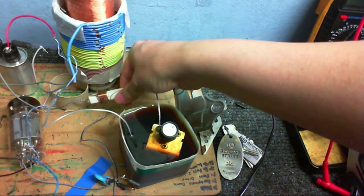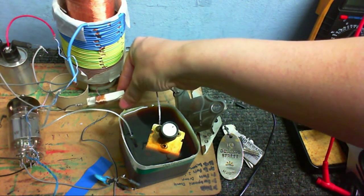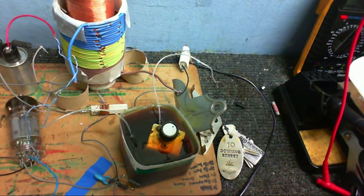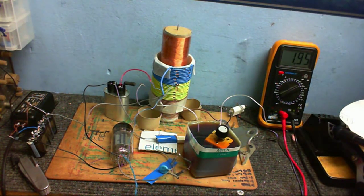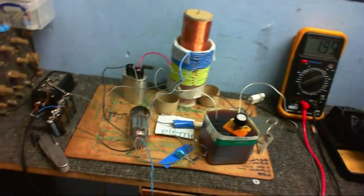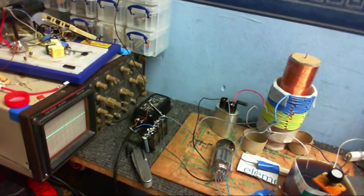Let's just see — make sure there's no wire damage. There's a little bit of a bleh, but my valve seems to have turned itself off. My filament keeps disconnecting. So I've put my meter between the power supply and the filament — just look at the amount of current that filament's pulling. Almost, well, just shy of 2 amps. That's just insane. Mind you, not as insane as the GU81 that I've got — that's going to pull 11 amps, according to Rodolkel2007 and a few other sources.